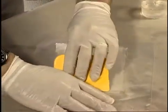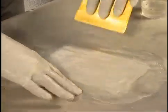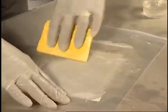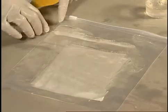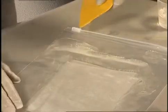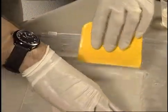In the interest of time I'm going to move to the next step, but really what you'd want to do is continue to work this resin until it is thoroughly wetted out. You take the excess resin and squeegee it off to the side — that's all excess resin that would have added weight to your layup, and now you don't have to deal with that.